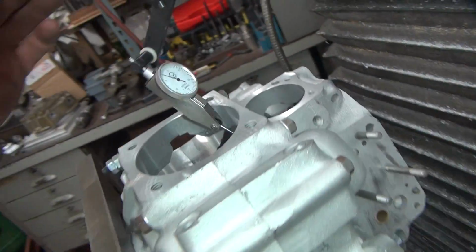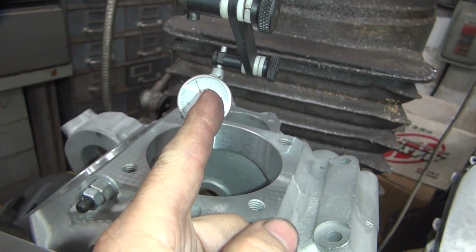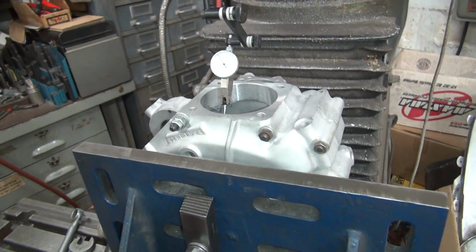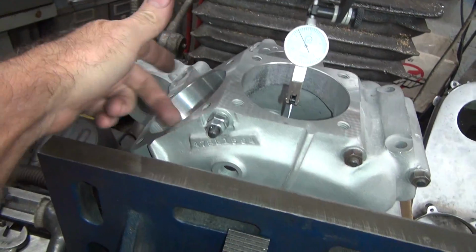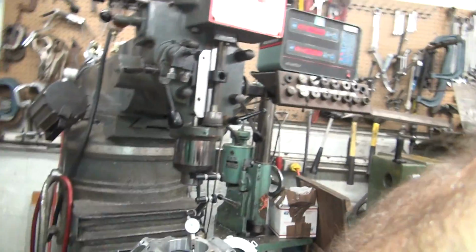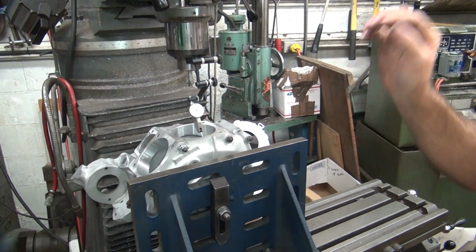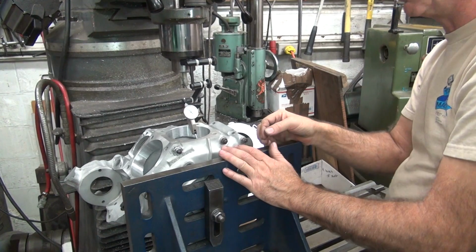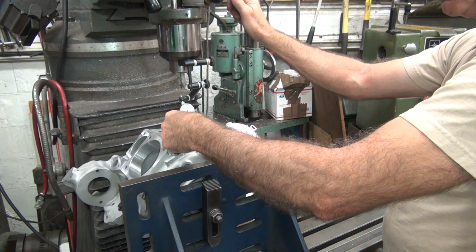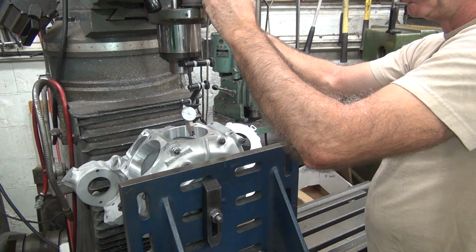We're plus 3 degree. And you can see the air. It's just past zero. So there's only a 2 thou difference in cylinder location from this one to this one, even though I didn't even check that at all that way. That's just how close I got these bores equal to what they were before, assuming Harley hit them within 2 thou. I'd say it's probably safe to say they're in that ballpark area. So all my universal jigging put stuff pretty damn close to where things were before or should be. So it's like I'm just guessing here. We are coming up with fairly accurate work. Some people don't think you do it, but that's their problem.